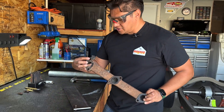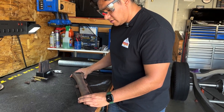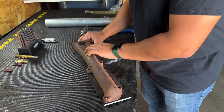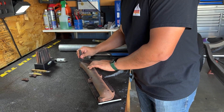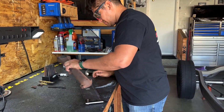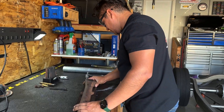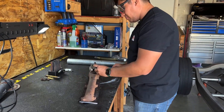This is actually a bigger hole, so I'm going to flip the part over so I can get it a little bit more centered. I'll just kind of eyeball this here, grab the transfer punch, and give it a little smack. Let's go drill that hole. Alright, that's looking pretty good. Just continue on the process.